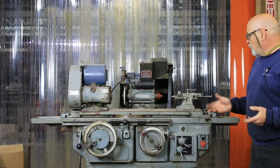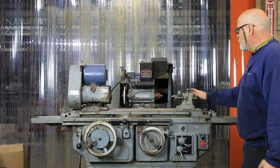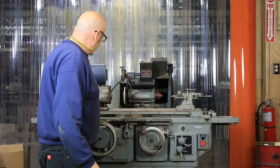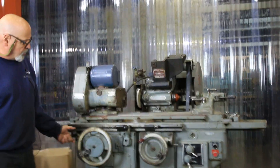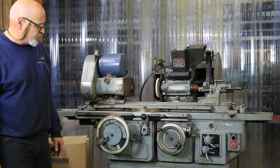The tail stock usually has to come off, and then we fold the spindle down. We'll probably do this in two sections — first I'm going to show you the machine running. Here's your spindle, and we lift up this lever here, we start our internal headstock, and then when we come up all the way we start our table. This machine is currently wired for 440 or 460 volts.